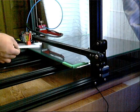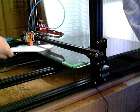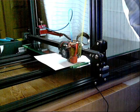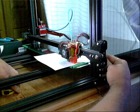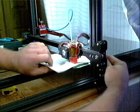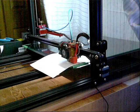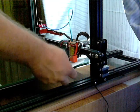Down just over 3 and 1/8, this side is 3 and 1/16. So I go to bed leveling, level my corners — it's perfect, that's where I like it, just barely snug, could be a little tighter. Next point — it's not even going to be close because I measured, so it's not even touching. I hold the tape measure up there and lower the stepper by hand — about 7 or 8 clicks. Now it's perfect and it measures 3 and 1/8, just like the other side.